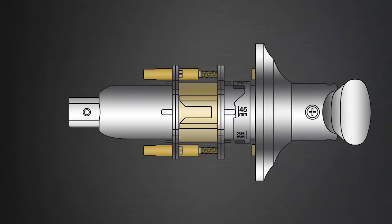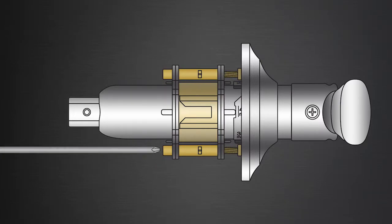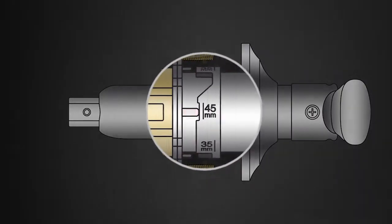Slide the adjustment ring and mounting plate back against the lugs and thread the screw posts onto the mounting plate. Tighten the screw posts with the Phillips screwdriver and verify the lugs are aligned with the correct notches.